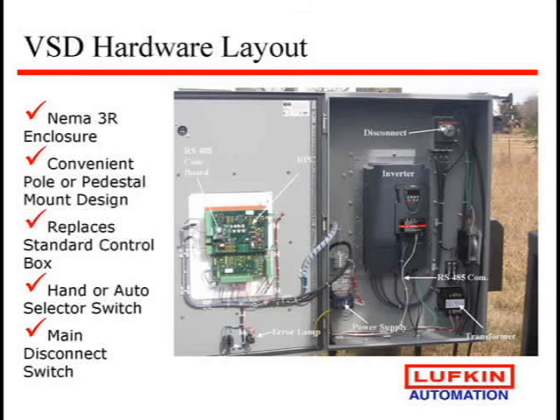Here's your typical layout with the inverter. All you're doing is bringing three-phase power into the inverter. The inverter converts it typically to DC and changes the Hertz. Normally you're at 60 Hertz — if you change the Hertz it changes the speed of the motor. The motor is like a bunch of magnets turning on and off at 60 Hertz; if you change that Hertz the rotor spins at a different speed. So it's truly a variable frequency drive — some call them VFDs, Chevron calls it an ASD for adjustable speed drive. We call it variable speed drive just to avoid confusion about frequencies.